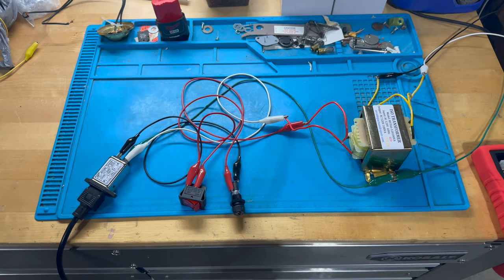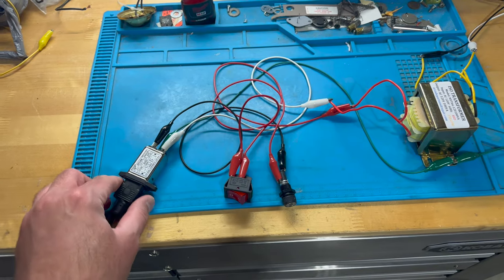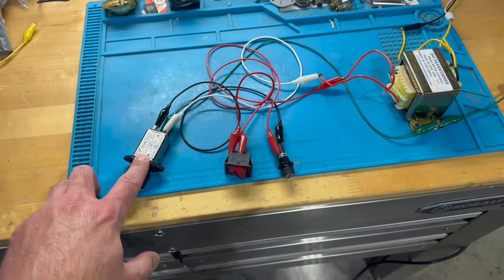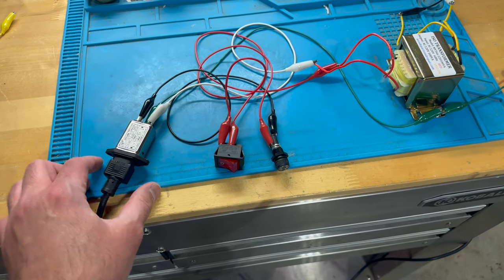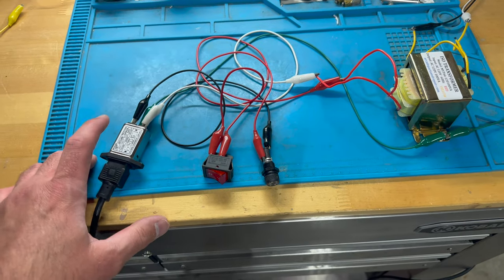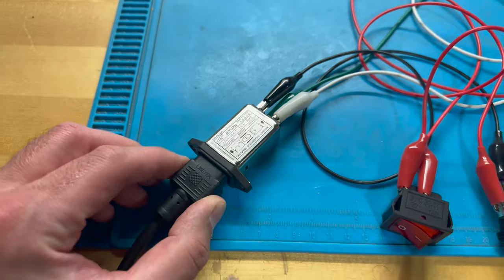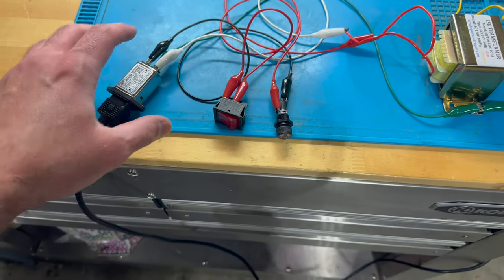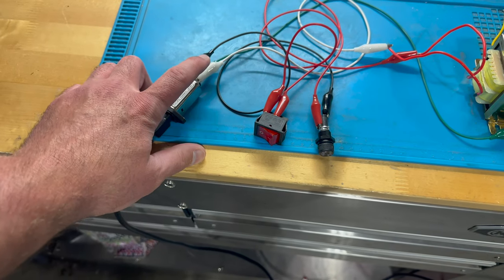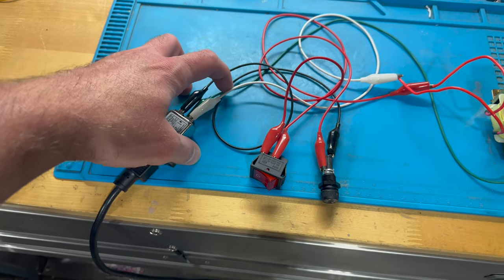But basically, in a nutshell, what we've got going on is power comes in from the wall. This is actually like a computer power cord, and it goes into this connector here that I will attach to an enclosure. But this has a built-in line filter, a 10 amp line filter. So the power comes in, and it has three connectors. It has the live wire, the neutral wire for AC, and it has a ground plug,